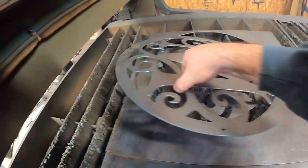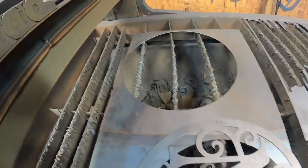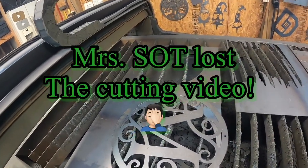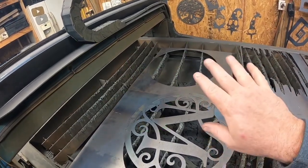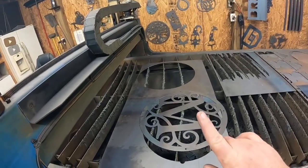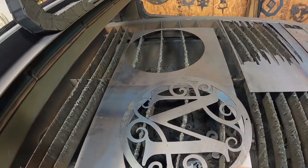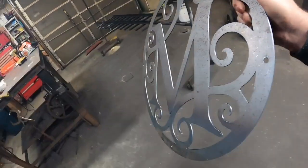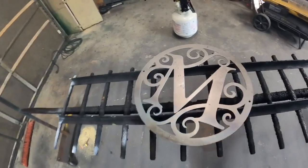All right, so got a store of parts down here in the bottom. But if you guys seen there on the old table, stop the camera a couple times, stop the torch. Those tip ups on these monograms is notorious for ruining a whole sign. You will ruin a whole sign off one little bitty piece or part that tips up and hits that torch. So always keeping that in mind. I mean, it's a constant battle. It is terrible sometimes.